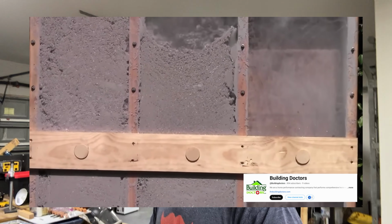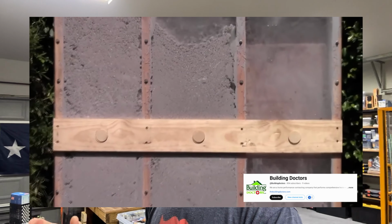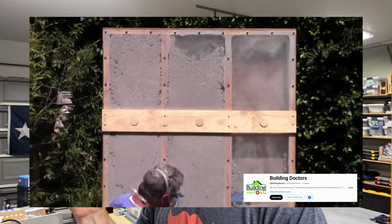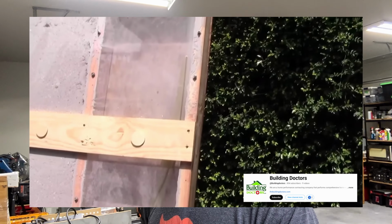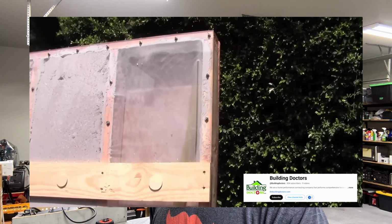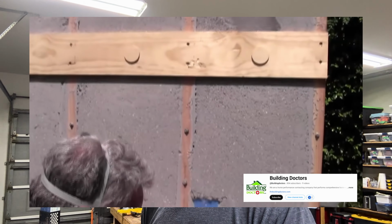What they did was they drilled holes in each bay, and then they pumped a fluffy fiberglass material densely packed into each of the stud walls. They also did the attic rafters so that this is a nice and insulated space, because eventually I'll be installing a mini split on this shop. That did leave me with over 140 holes to go fill.